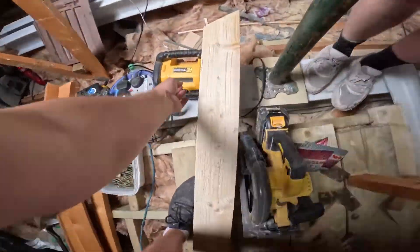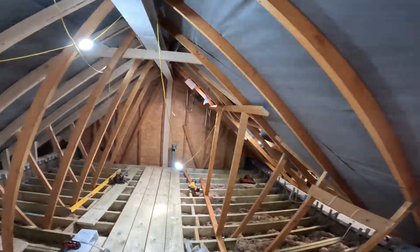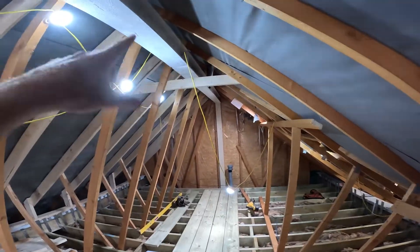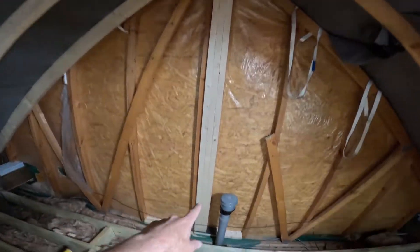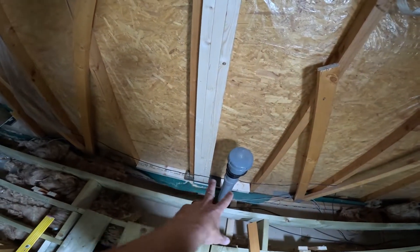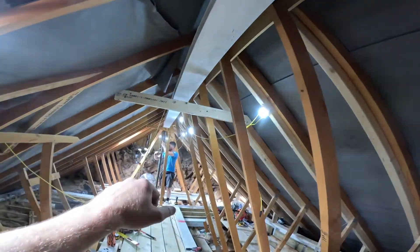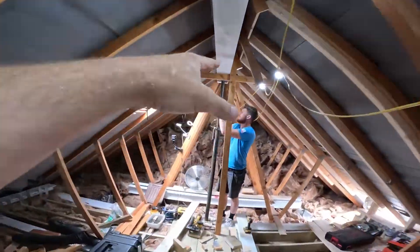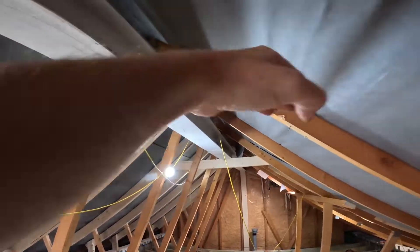Let's crack that radio off — don't want any copyright claims. Darren has popped in to help me and Jay lift this beam. What we've got is a timber post that sits down onto a bearing plate, and underneath that is the brick or blockwork — same as what we've done for the main steel. This is the height I want it finished at.